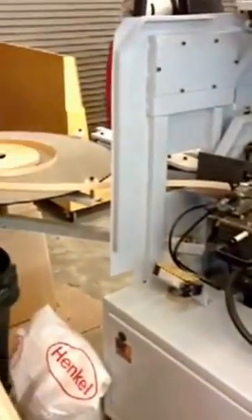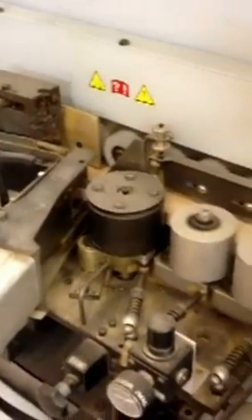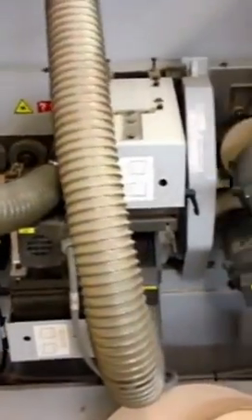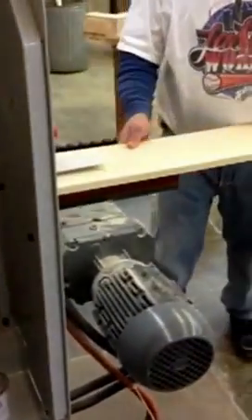I'm going to send that long board back through again. So that's the glue pot and the glue applicator — it's hard to see. The pressure rollers, there goes the front trimmer, those two hoses, the top and bottom trimmer, and the buffer. Here comes the rear trimmer. You can see the little tape hanging off there, and the part's done. Simple as that.